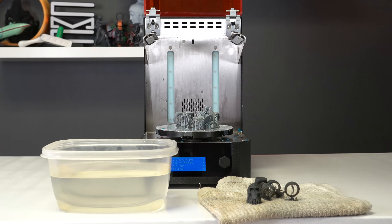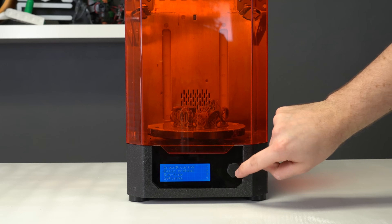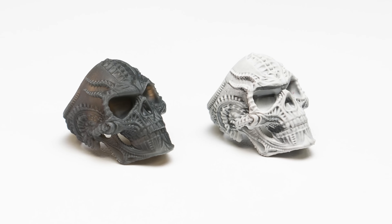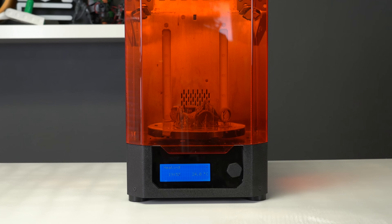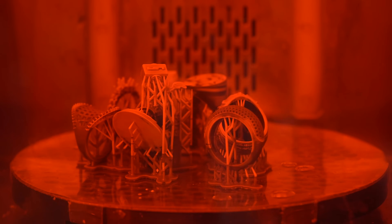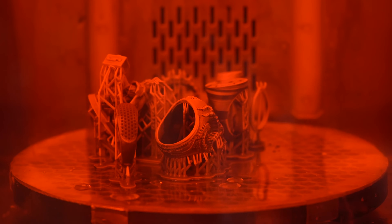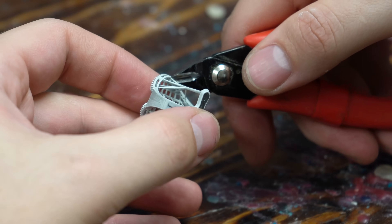There is no further UV curing required after the alcohol soak. After soaking, you will notice that the prints have changed color, going from dark greenish-black after initial printing to a bone gray color. According to Bluecast, color uniformity is not too important for this use case. Leaving prints to soak in alcohol for too long may cause print breakage or poor casting results. Having a few minor darker spots, in our experience, does not affect overall casting quality.